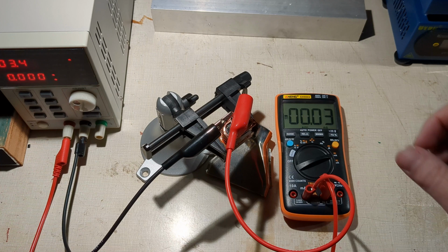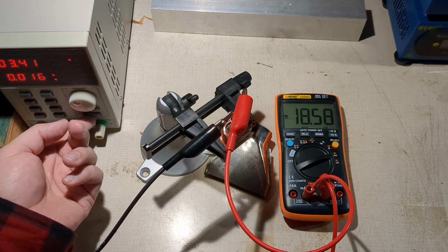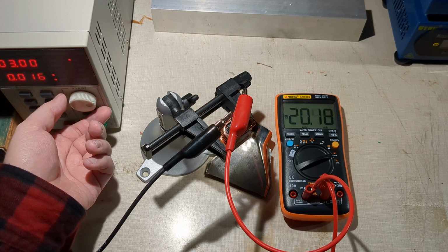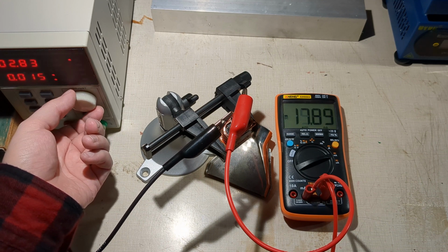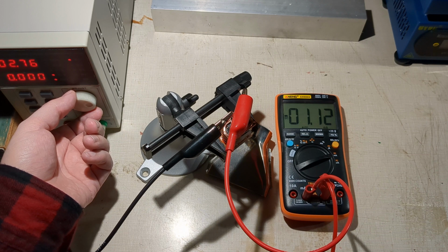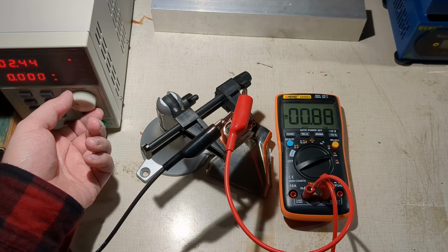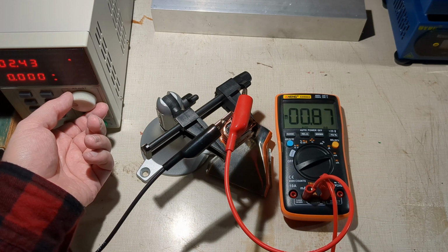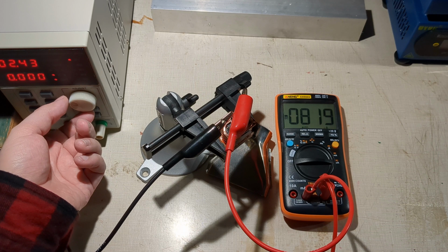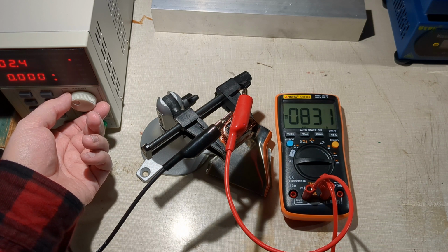And turn it on. Let's turn the voltage down. We'll see what happens again around 2.76. Okay, 2.76, it's switched off and the current has dropped to 1.12 milliamp. I keep turning it down. So just under a milliamp. 819 microamps. Pulls about 1.1 milliamps.